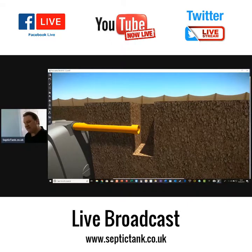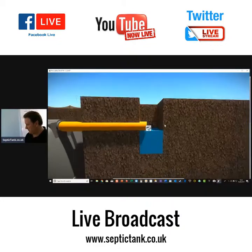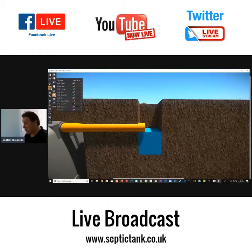So what now? The next day, refill the test section with water again — so we put another 300 millimeters of water back into the hole. This is where it gets really interesting, because you've got to let it drain away to about 75% — wait until 25% has drained away, then get your stopwatch ready.